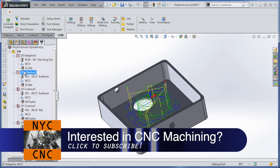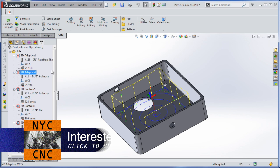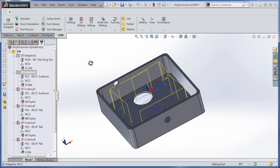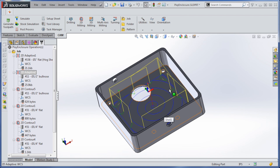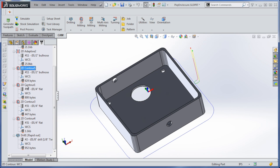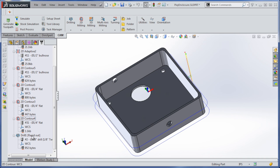I love the Shear Hog because it doesn't chip weld, cuts great. We're gonna come in with tool 11, which is a roughing tool, but it creates a great bottom finish, and that's going to clean up this bottom face. Then clean up the outside first — these are all 2D contours. Quarter-inch to clean up the inside, quarter-inch to take out that little pocket, quarter-inch to clean up the outside, and then we drill.